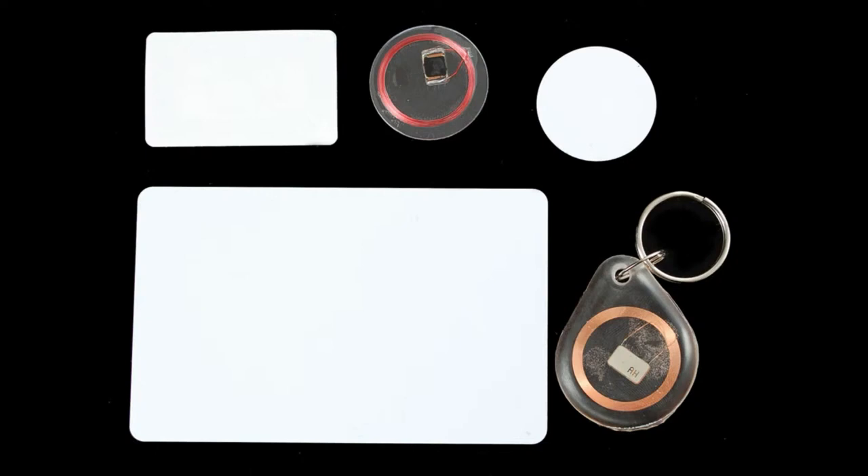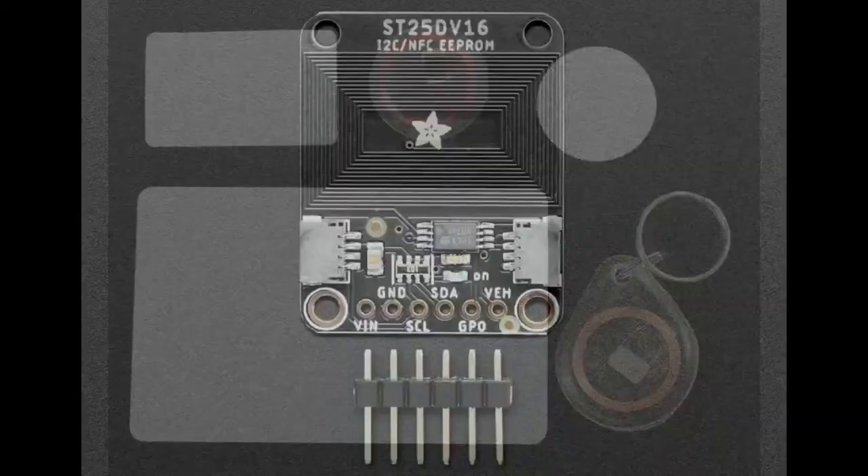That's an RFID chip that is fully powered and takes data over the RF link created when energy enters the coil — that is the data and power transfer. NFC is near field communication, a larger scale thing than RFID, which is very specific just for identification. These tags have memory built in and you can read, write, or authenticate through them. They're used for public transport identification or NFC in your credit card. They're inexpensive but they're not smart — you can't run code or have the data inside the tag change on the fly. Whatever you write to it is what you read from it next time.